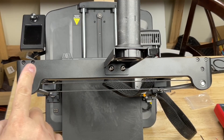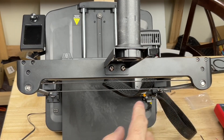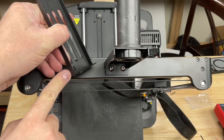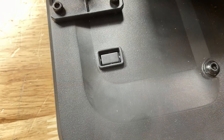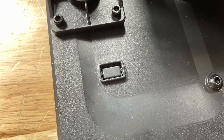To feed from the top down I have to take the cover off on top with six screws and lift it off. The channel is underneath there and I also need to change the bracket because they include a new bracket with a mount for the filament sensor. If you don't want to do all that, there is a hole with a knockout — knock it out and you can run the wires up through it. It's not as clean but it's easier.